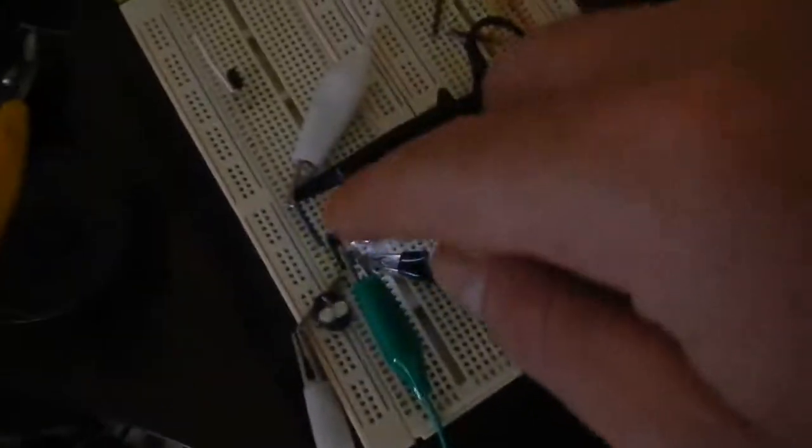Not many of my single wire receivers. That's a blocking diode, protection diode for my transistor. I'm using a TIP122. And we can see our harmonic on the scope there, hopefully. And you'll see that I'm currently running on the second harmonic.